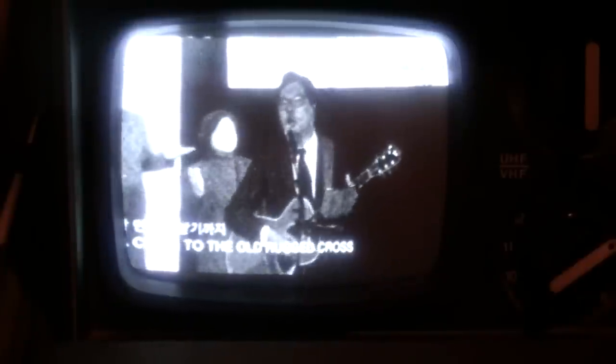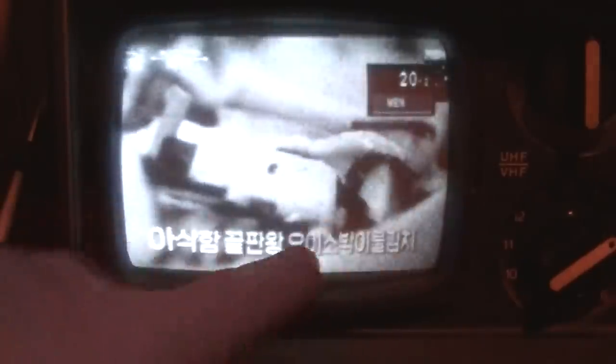It really does not look that bad as it does in the camera. It's too dark in here. It works very well. I think there is some capacitor issues. See how it's brighter on this side and it's darker on that side? I think that's probably some low ESR capacitors. And see, it's bright here and it gets darker over on this side. We have something here that's highly entertaining. See what we can do here.